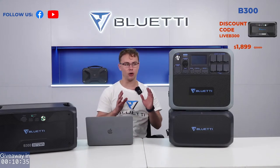Okay, so power is 200 watts maximum input, lamination is ETFE, cell type is monocrystalline silicon, cell efficiency is up to 23.4%, voltage at max power VMP is 20.5 volts.